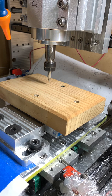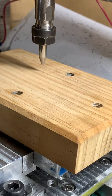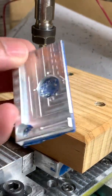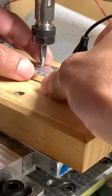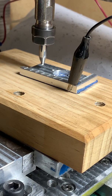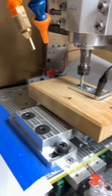We have a piece of aluminum that's three millimeters thick. We're going to use this to find the zero on the Z-axis. It will touch it twice, and when it's done it's going to go back to the switch to get the offset.